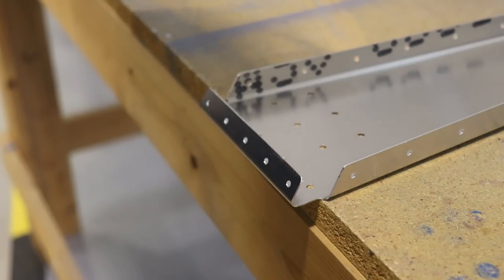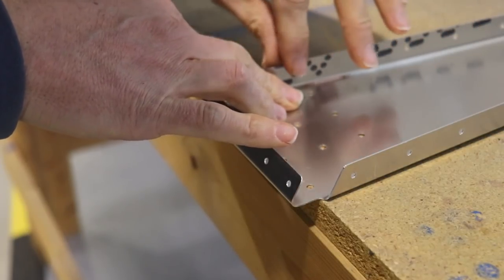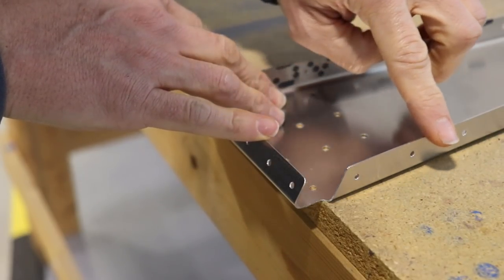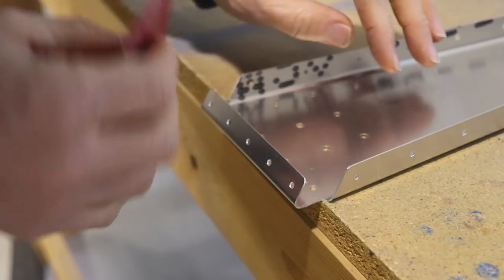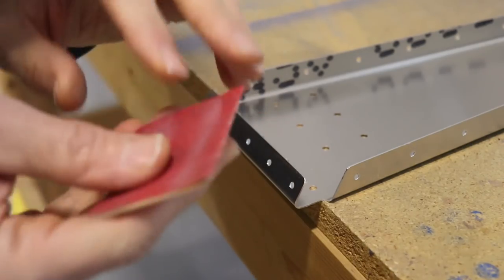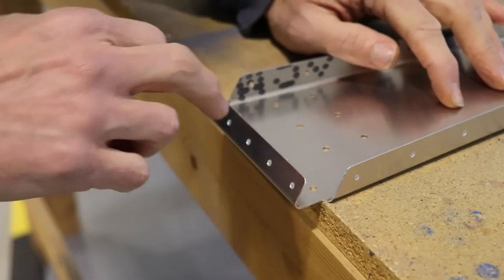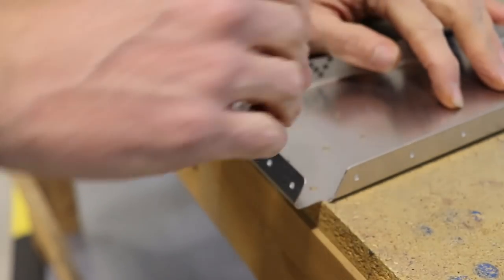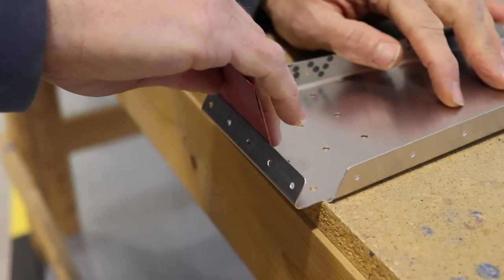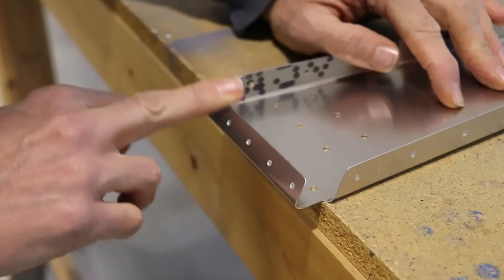One other thing I want to mention about prepping your parts: run your fingers along the edges. The CNC machine does a real nice job of cutting these out, but sometimes you'll feel a little burr on the edge just like the holes. What I like to do is take 400 grit — actually this is 320 — sandpaper and go over the edges. I make sure I get the top edge and the corner, so I take the sandpaper and round it, getting the back corner, then flat, then the front corner, and that just makes it super smooth.